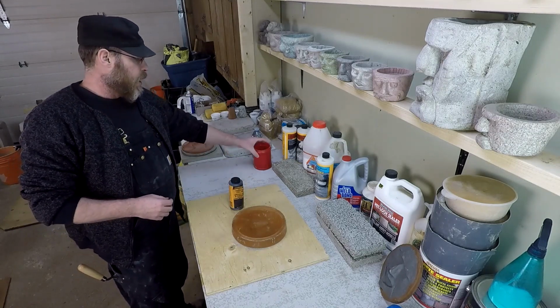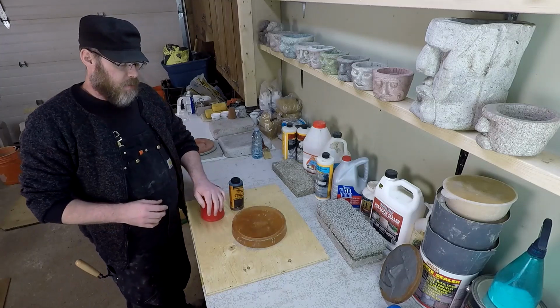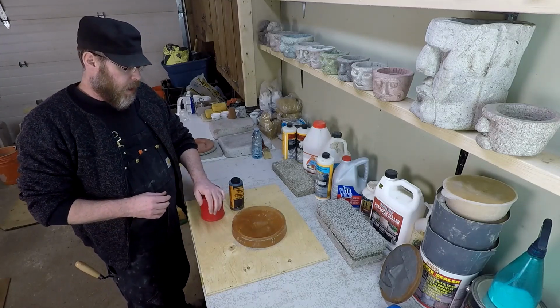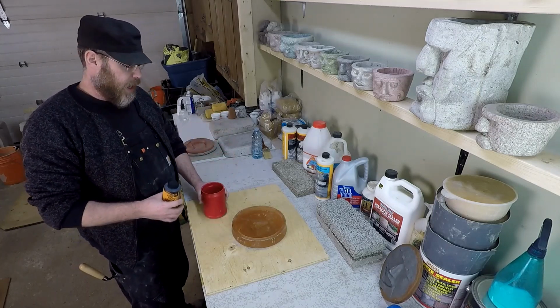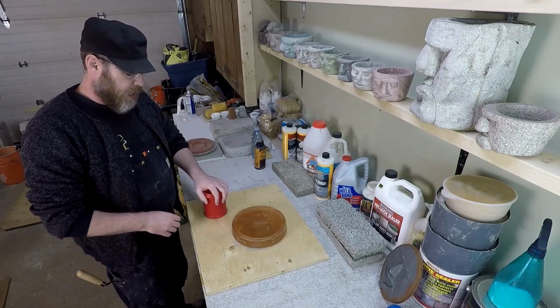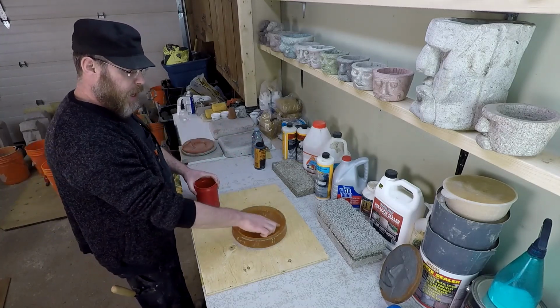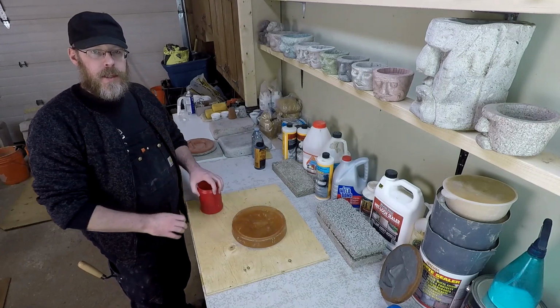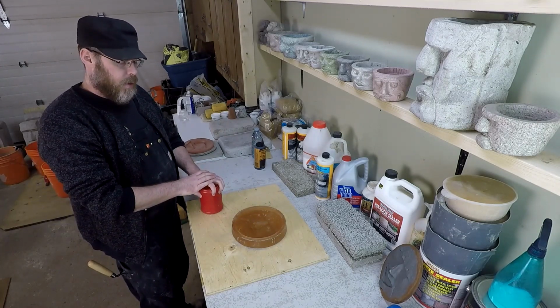And then the amount that I use in the slurry, which is what I'm going to get the finer detail with in here, is basically the smallest amount which I can pour into this container. I know some people were asking about that before. And the reason why is because I need to be able to paint in a fine Portland slurry in there to make sure that I don't have honeycombing of the concrete.